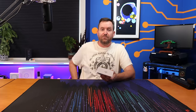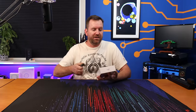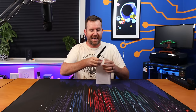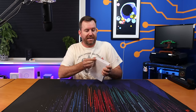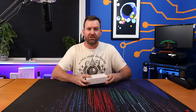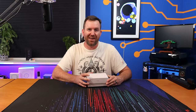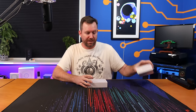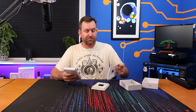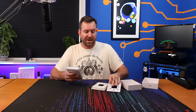Okay, so let's pop this thing out of the box. The U6-In wall is, of course, Wi-Fi 6, which means that it has some features that allow for more client density. In fact, this device is capable of 300 plus concurrent clients. Now, the form factor of the U6-In wall is made to fit over a single gang electrical outlet box. Ooh, look at this thing. Whoa. And it comes with all the hardware that you need to make that happen.